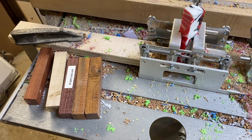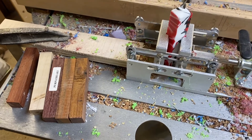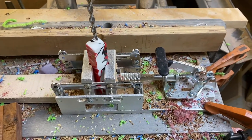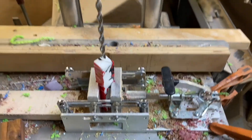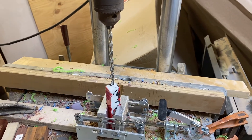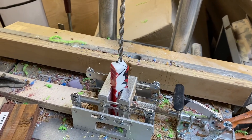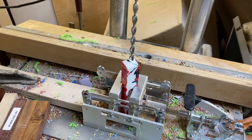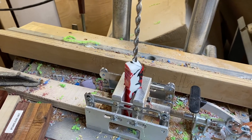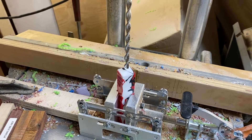I've got everything cut to length. I was going to do it on the bandsaw but the bandsaw is having a bad day, so I end up doing it on the chop saw, which is fine — didn't throw anything across the room. Now I'm going to put everything into my vise and the bit I have in my drill is a seven millimeter bit, long enough to go the whole way through the blank. Especially with modified slimline pens, you want your hole to go the whole way through and be even, because otherwise the pen kit won't line up. So definitely get yourself a longer drill bit.